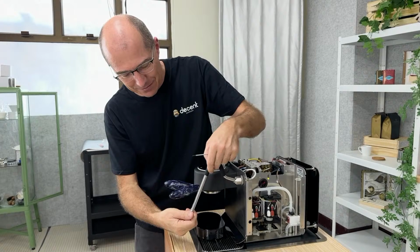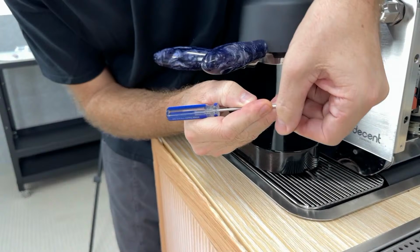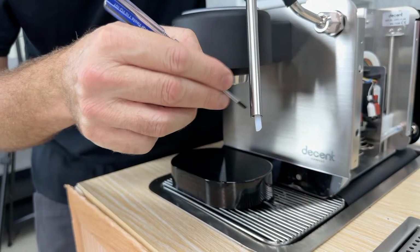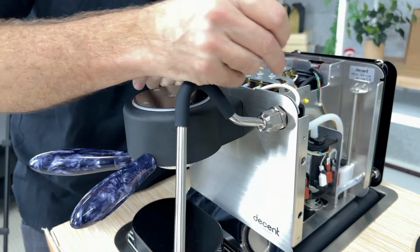Teflon. And you can see that if I unscrew this tip here, and what I'm gonna do is just put a little tool here to keep myself from pulling out the tube. Okay, so there's our Teflon inner tube, and it has an O-ring right here and an O-ring right here as well. The only place that gets hot is this bolt, because this is all a ball joint and there's no way to have a tube through that.